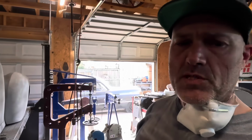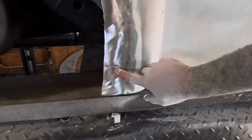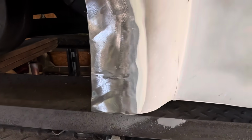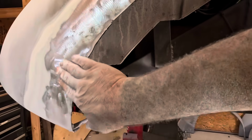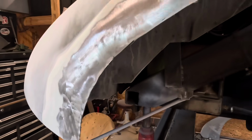Well, at least it wasn't plaster. Just good old, you know, the fix-all, that magic salve known as Bondo. Which actually, I'm not sure why most of it was even there because the metal's not even that bad. But one little spot, right there, I mean, 2 minutes with a hammer and a dolly and your grinder, you probably didn't even need any. So that's a little weird. But other than that, a couple little rough spots there that could very easily have been worked out.